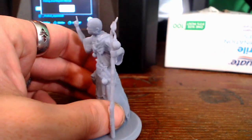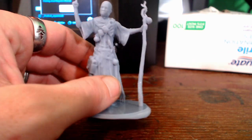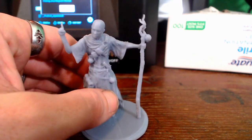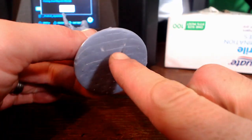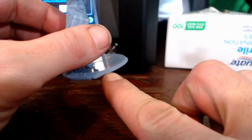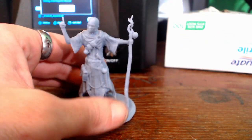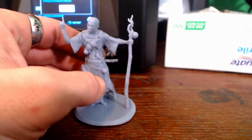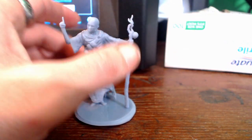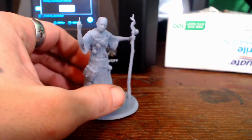This is one of my first prints with this machine — I do have a couple other ones laying around. But I do have a little bit more dialing in to do with the settings. Particularly down here you can see that I did have a little bit of lifting at the base. That is not the printer per se — I think I need to go in and tighten up the FEP sheet in there, the little plastic part that it builds on, because I could see it flexing a little bit as it was printing. But I'm still very, very pleased with the outcome.